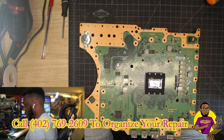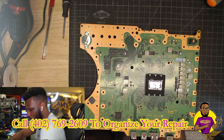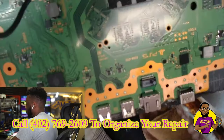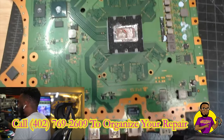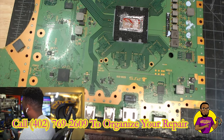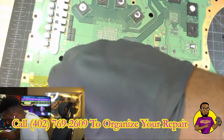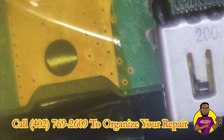What we're going to do is go one by one. First, before I even grab the kapton tape, I'm going to clean around this entire header. I'll take my toothbrush, dip it in some IPA, and do a thorough clean. That should be good enough for now. Next we're going to take our kapton tape, place it all around the HDMI header, and get this old HDMI port removed so we can get a working HDMI port on. We've got the kapton tape over the HDMI port — let's go back under the microscope, heat this up, and get it taken off.